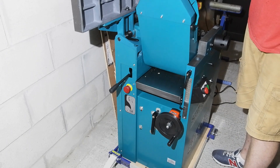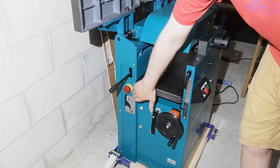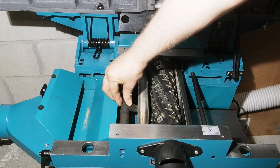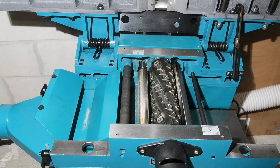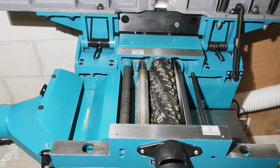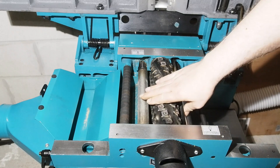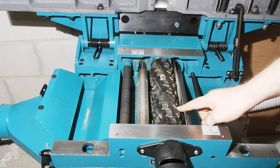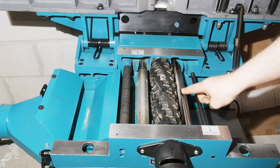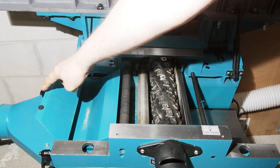With the tables up you can see more clearly where the cast iron pieces are and where the folded steel starts. At the business end of the machine, as you'd expect, you have a row of metal anti-kickback teeth, a metal corrugated infeed roller for grabbing the workpiece, a 255mm spiral cutter block with 63 fifteen-by-fifteen millimeter carbide cutters, and a smooth metal — looks to be stainless — outfeed roller so as to not mark your work after cutting. The last bar with a little grub screw in the center is just a support to capture the extraction hood tab.